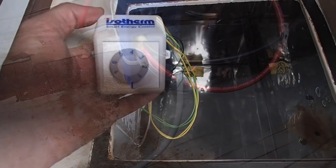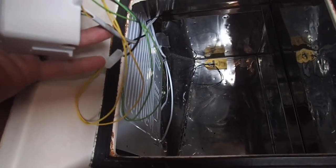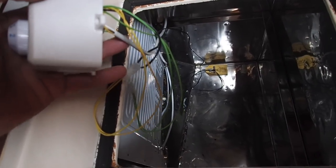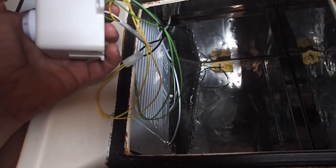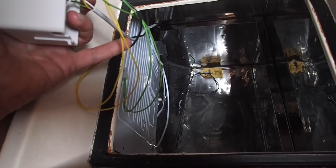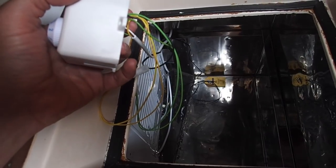We are ready to go. This is our thermostat and our control system — we are going to mount it somewhere here in the box. You can see these wires coming off. This white one is the one that goes to the control unit, the electronic control unit on the compressor. These yellow and green wires are not important to us because they are for a lamp that some systems have but we do not — I think you can buy it and add it on if you really want to. And then this black wire is going to be our temperature sensor, and we're going to attach that to the plate itself.